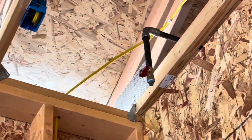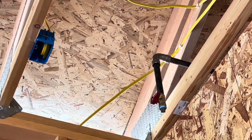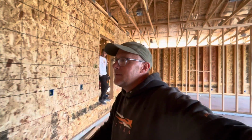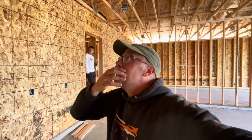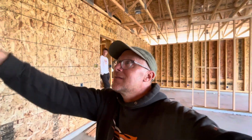One thing we did add at my brother's suggestion, just last minute yesterday, is we ran gas pipe up there for a heater, and then I just ran a power outlet. One thing I didn't realize until I talked to him today is that you have to vent it through the roof, at least he did. And I'm like, oh man. I'm gonna see if they vent out of the side.